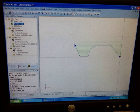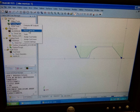We're going to go ahead and put your mouse on Turning Tools, which is up in the CAM part tree in BobCAD. When you right-click on that you'll get an option to Post and Save As. You'll notice in the bottom left corner it should have a bunch of letters and code — that's the code we're going to export. We're not saving a BobCAD file; we're saving a post file for the computer to actually read.